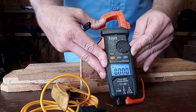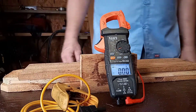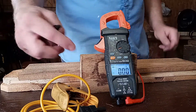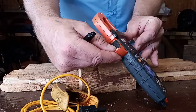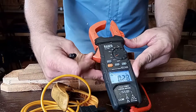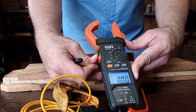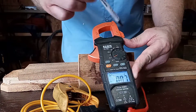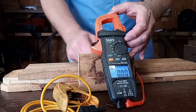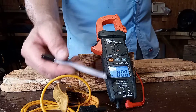Amps. Let's say you want to check your amperage on a fan motor on an AC unit. You look at the nameplate to see what it's supposed to be pulling. You also have a rubber grip on the clamp here too, which makes it nice and easy. You wrap this around the wire that you want to get your amperage on, clamp it around — the wire sits right inside. It gives you a nice amperage reading with no problems.